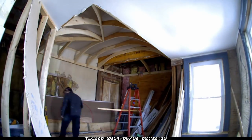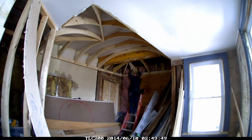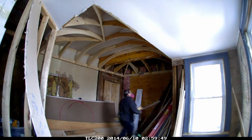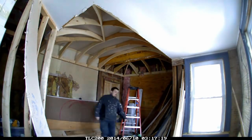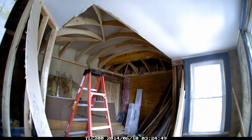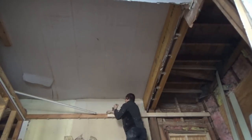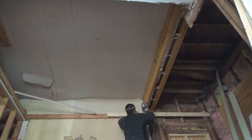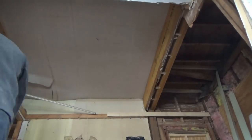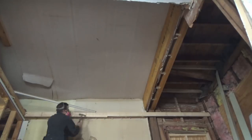This is the framing — I don't think anybody's seen this so far. This was all framed essentially using math. You could have built this just like conventional ceiling framing, like a hip roof, the only difference being instead of flat rafters you're arching them. Most of it's pretty straightforward except for your hips, because unlike a hip rafter where you can use basic math to align them, you have to scribe the arch from your common rafters onto those hip rafters, then measure and cut your jack rafters to keep all those arches linear all the way to the corner.